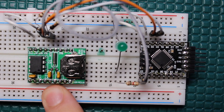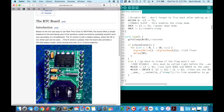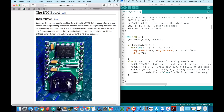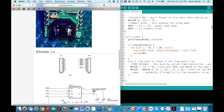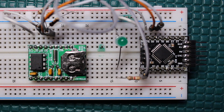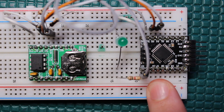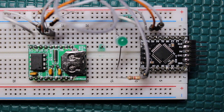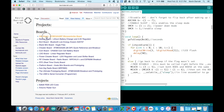I did a full video explaining how this real-time clock works. This is the MCP7940 real-time clock from Microchip — it's also battery backed, so if you need to keep time even when power is removed you can do so. I've got the schematic up here. This is I2C-based, so we've got two wires going back to the Arduino with 10k pull-ups on each, and we're using the multi-function pin as the alarm output from the RTC to the Arduino's interrupt pin to wake it up.